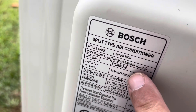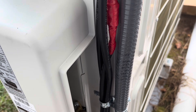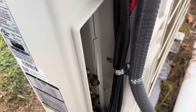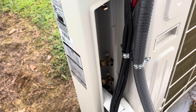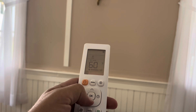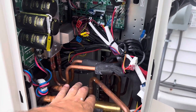This is a four-ton unit and it'll do up to five heads. I wonder if they have this for later expansion — maybe if they want to add a couple more heads later. Because I think those two that are side by side are 18, so that would be three tons. Maybe they're maxed out with a ton in that little office. All right, we're gonna turn the last one on now. These are all three running. All right, fellas, I think we're good. She's running wide open.